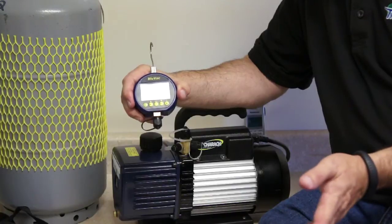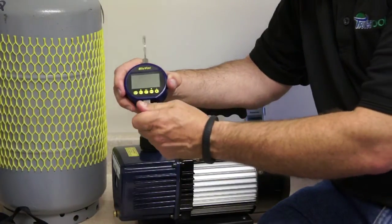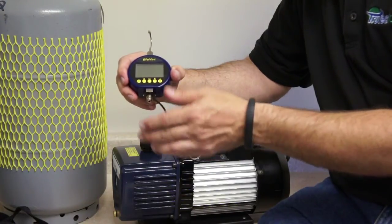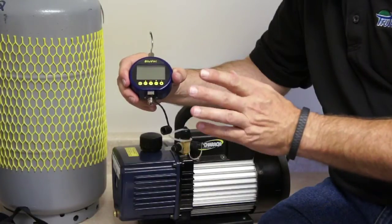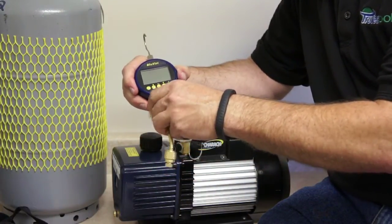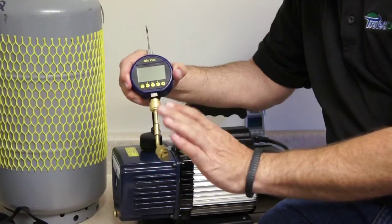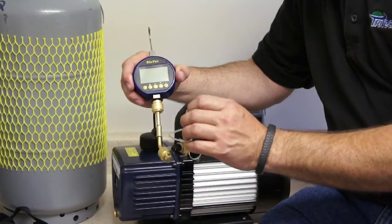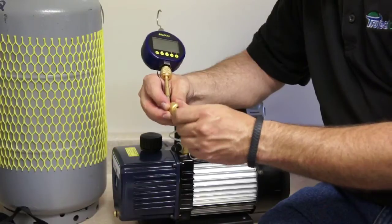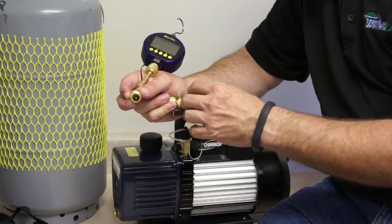Let's start with what I like to call our micro rig — simply what we attach the vacuum gauge to so we can isolate the hoses from the vacuum gauge when doing our decay tests. Everything is capped. The reason we sell our Evac kit with plugs is so you can keep things capped, clean, dry, and tight. I'm going to connect the vacuum gauge — I already have a small amount of Nylog on this fitting so I don't need to add more. We want to use enough Nylog to connect the gauge and that is it; too much Nylog is not a good thing.